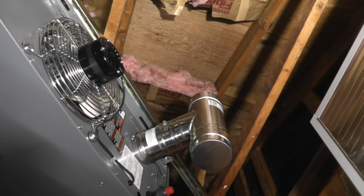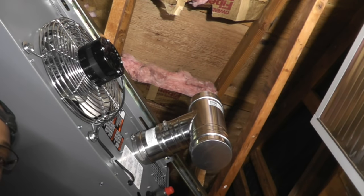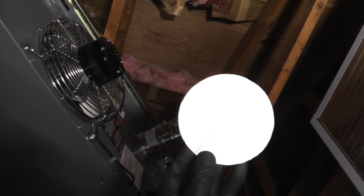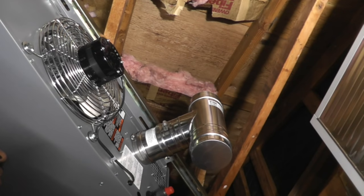On the roof I'm finding the center point of the pipe that's going to attach to the T. I've taken a piece of cardboard the same diameter as the pipe and put it on top with crosshairs so I know where the center is. Next I'll take a plumb bob and find the center point.